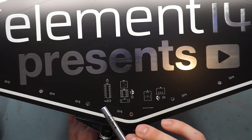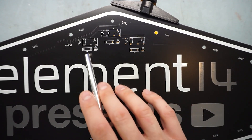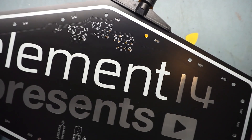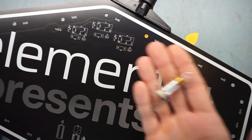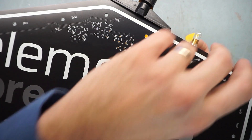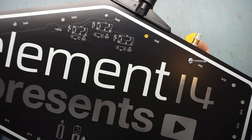Once that's complete, we'll install the CD4017 and make sure that we have the proper sequence coming from that. And if we are successful there, we will move on to installing the relays and the driver circuitry — the transistors, the bias resistor, and the protection diodes. As far as the mounting of the lamps, I have a six volt lamp here that will mount to the rear of the circuit board, and then we'll install our rivet and use our rivet gun to pop the little nugget there.